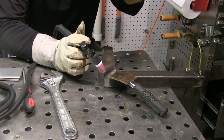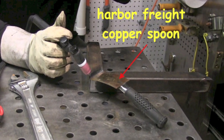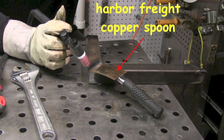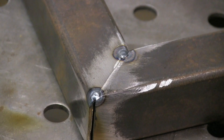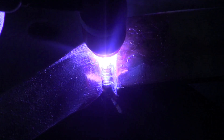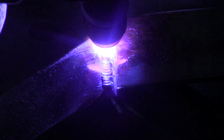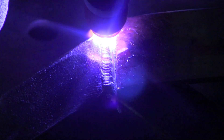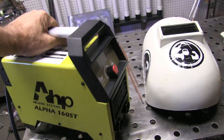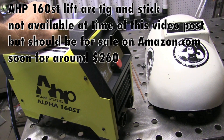Another use is just light fabrication — this is some 1.5-inch square tubing with 1/8-inch wall. A Harbor Freight copper spoon for about $10 is a really handy tool for scratch start and lift arc TIG. It provides a way to leave a puddle without completely losing gas coverage and maybe leaving a crater or fisheye. For a joint like this, you set it right next to the bead — it actually helps trap a little argon there. When you get to the end and you're ready to trail out, you just move over to the copper spoon, let the puddle solidify while you get a little gas coverage, and then snap out. Scratch start and lift arc — not nearly as good as having a foot pedal most of the time, but not too bad actually.